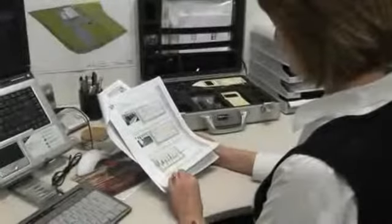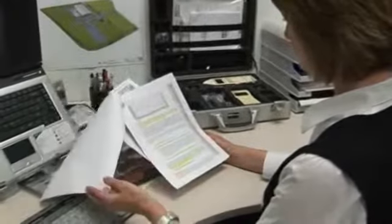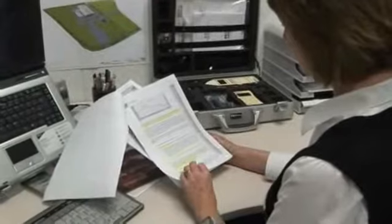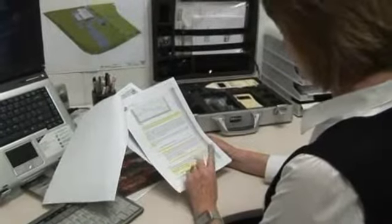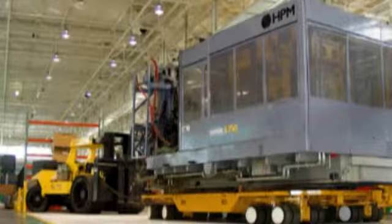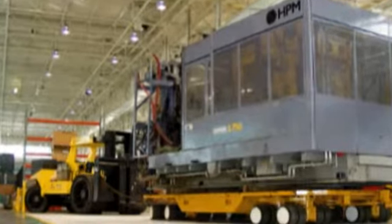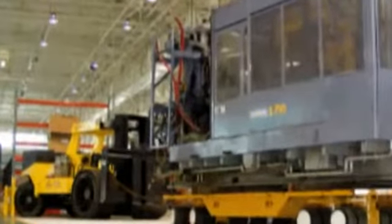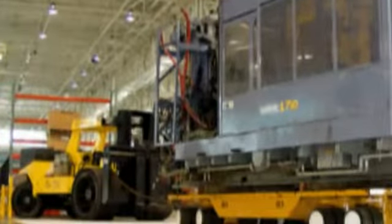The principal aim of a factory noise survey is for it to be carried out in a reasonable time frame, with the results communicated to management using a report with actions and timescales. In most cases, noise surveys should be carried out every 2 years, or sooner as partial surveys if an area changes due to, for example, a new piece of equipment or process.